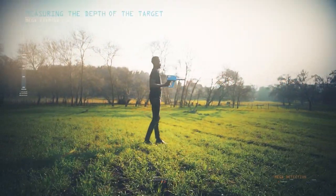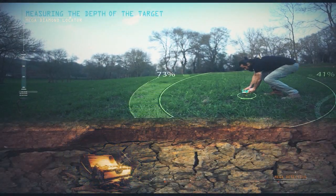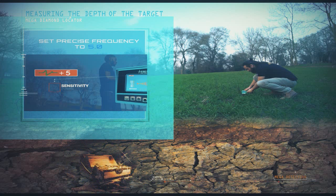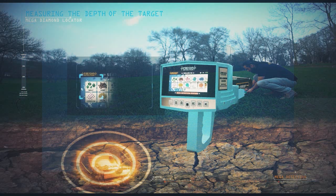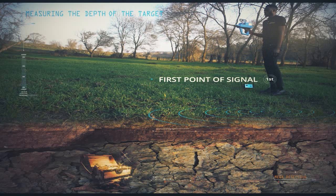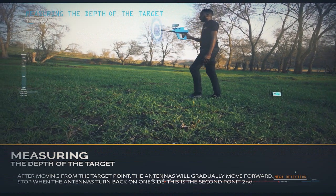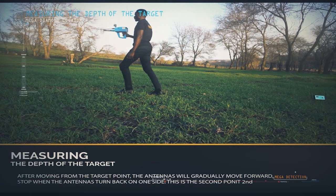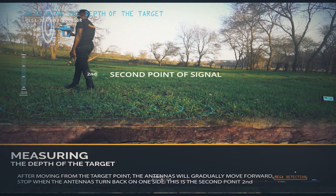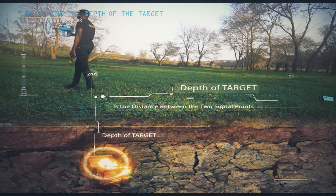Measuring the Depth of the Target: At the highest point of the target, insert the wedges or pegs from the Deep Master Unit about 8 centimetres into the ground. Set the precise frequency to 5. Select the target program from the main unit and wait 3–4 minutes. Stand on the target and watch the antennas turn to one side — this is the first point of signal. After moving from the target point, the antennas will gradually move forward. Stop when the antennas turn back to one side — this is the second point of signal. The approximate depth of the target is the distance between the two signal points at a slope of 45 degrees from the second point.